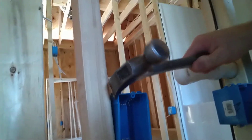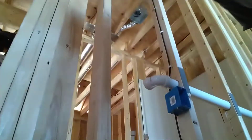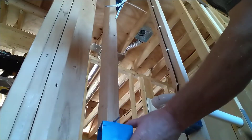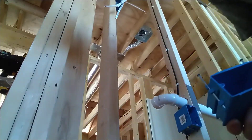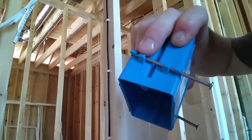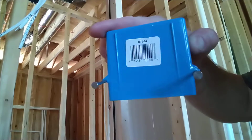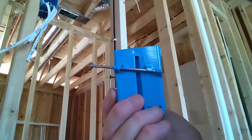You put it in between the box and the stud, cam until you see it move, then put it on the bottom and cam the bottom out. As soon as you get a certain portion, go back to the top. The idea is not to tear the plastic up but to keep the nails straight. Once it's out, there's no damage to the ears that hold the nail, no damage to the box — it's not stressed on either side. It's like new; no damage. Now you can use it over.